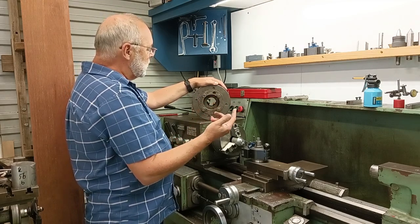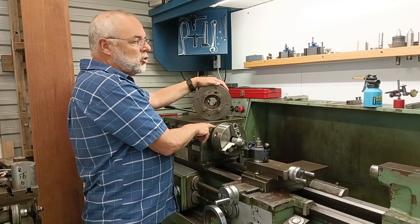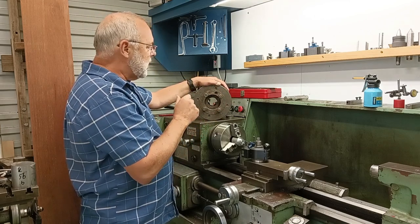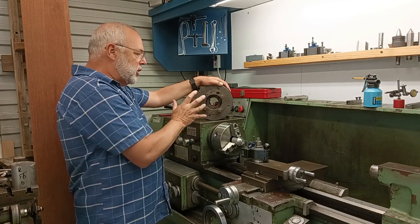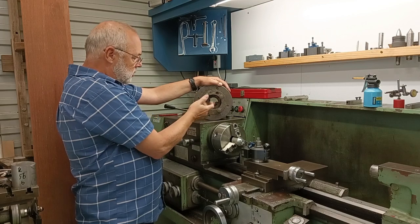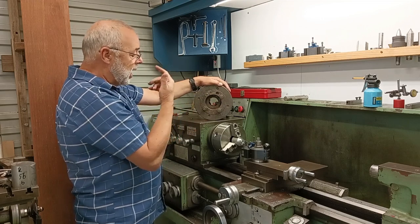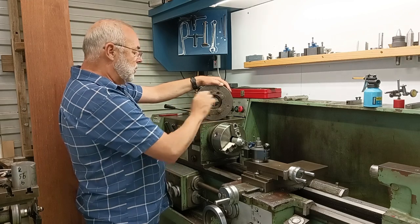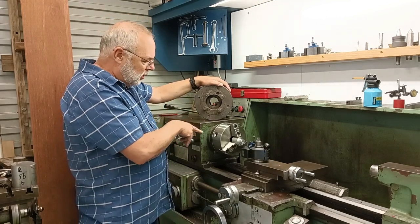Normally around that era we saw cam locks — a chuck would go on the side, and there would normally be three on this particular type, called a D14, or a D16 which was the more conventional standard. But because this was a Bulgarian machine, it was a variation of the cam lock system. Instead of cam locks you've got four studs sticking out, with nuts that you have to do up from the back. There's a little swash plate that rotates so you can poke through the holes and do up those bolts from the back.